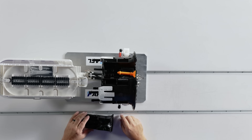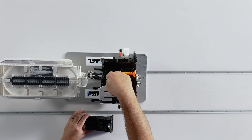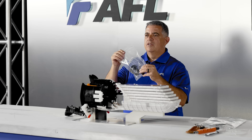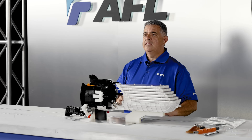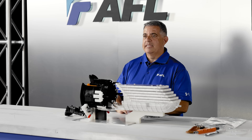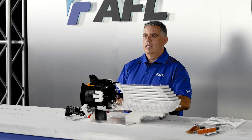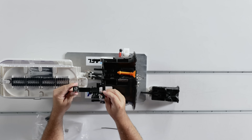The base also houses the cable attachment unit, or CAU, which is attached to the base by a single 3/8 inch bolt. This allows the cable and ground, if applicable, to be installed on the CAU on the workbench and then installed into the base. CAU kits are shipped with the APEX in the same box. Each kit provides strain relief for cable or cables in a single cable port in the APEX base. The CAU is a single molded piece to provide cable retention as well as to secure central strength member, or CSM, members.